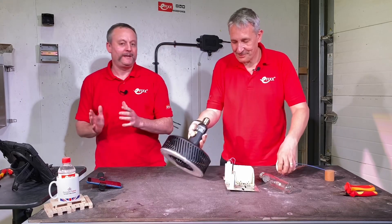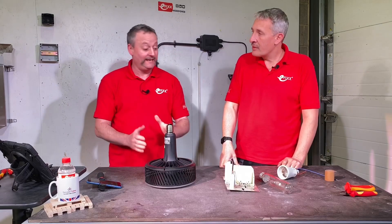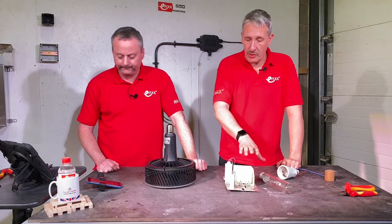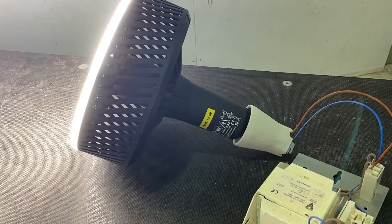It can't be that simple — there must be something else the electrician's got to do. It can't be as simple as dropping out the lamp and putting an LED one in when we've got all of this gear tray going. Okay, well that's where the universal element comes in. This will work with the igniter, the ballast, and the power factor correction still in circuit.